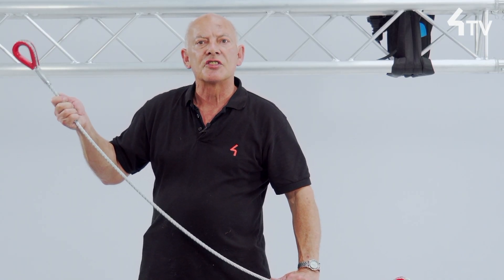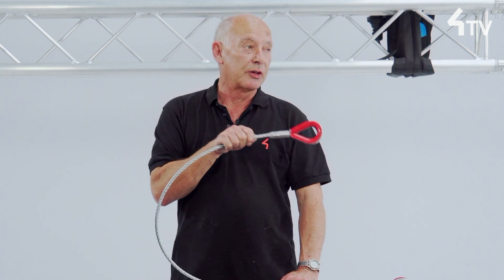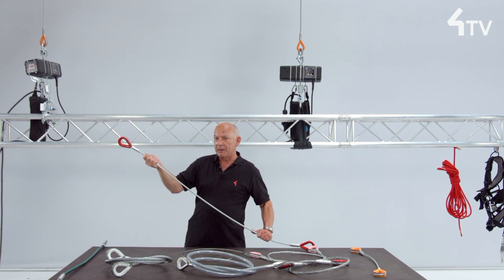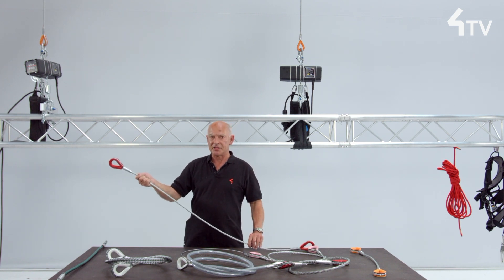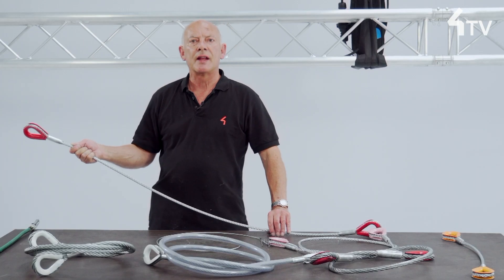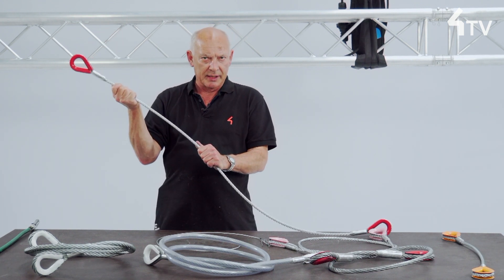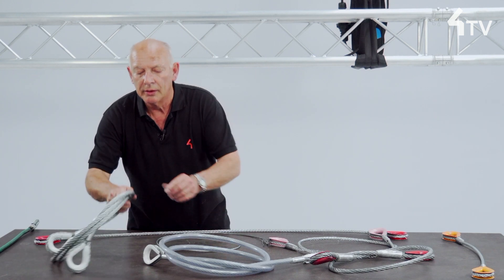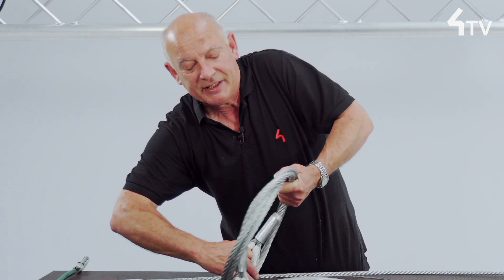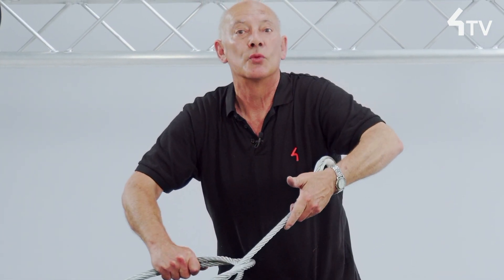A hard-eye sling is generally rated to a safe working load of a little over one ton. It is worth remembering that certain environments require us to work with increased factors of safety, and that the nominal one ton strength may be reduced to 500kg. For a standard five-to-one factor of safety, a two ton sling will be of 14mm diameter, and these may be derated to one ton in a ten-to-one environment.